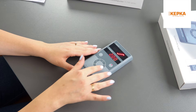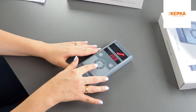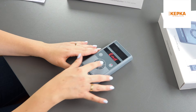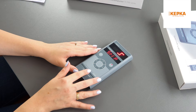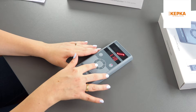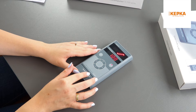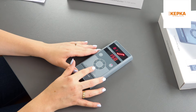Now I'm in the first segment. The first value that I set is time. I can set up time manually or choose the skip option, which heats as fast as possible depending on the type of kiln you have. In the first segment I'm going to choose one hour — within one hour I want my kiln to heat up to 150 degrees.